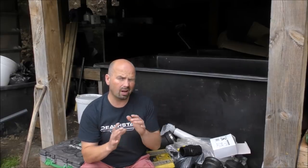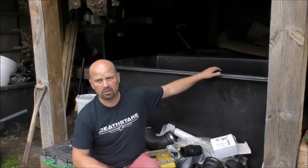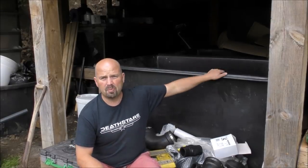Now the entire volume of all of these things put together is round about eight and a half to nine thousand liters, which is quite a big filter. Obviously it's going to take a hell of a lot of filling — there's going to be brushes and grog and moving bed, all sorts of different components. Eight and a half to nine thousand liters is roughly two thousand gallons, or thereabouts, maybe two and a half thousand US gallons.